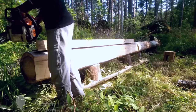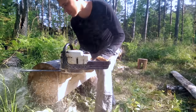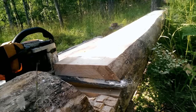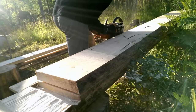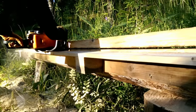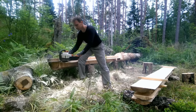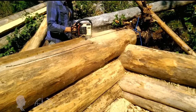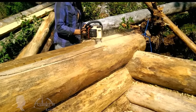I have tried many traditional lumber cutting techniques while building my log cabin at Lodega Lake. For example, this simple technique using a two-board guide screwed to the log works well, and you can cut boards as wide as your saw's guide bar. If the side of your chainsaw isn't flat like mine, you can fix a small piece of plywood to its side. This method is preferable if you need to make a shallow horizontal cut to an already installed log — for instance, for a window or a door. I successfully used this method while building my log cabin and I would recommend it to a friend.